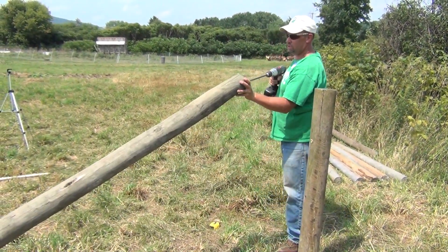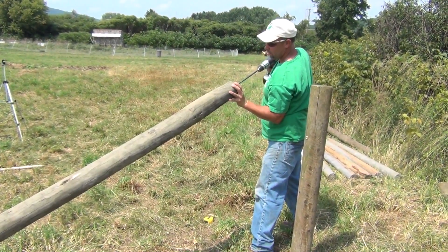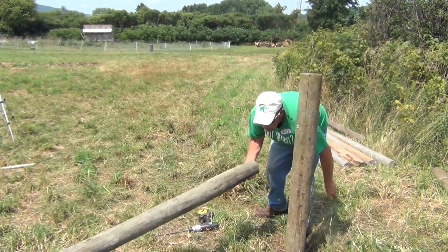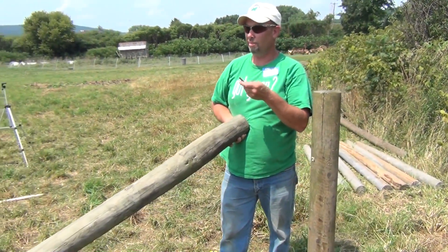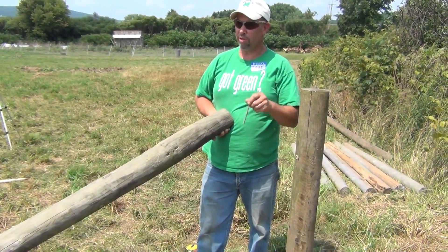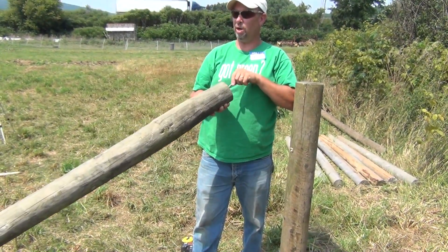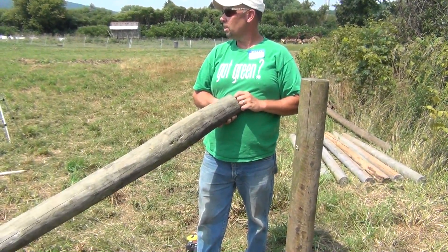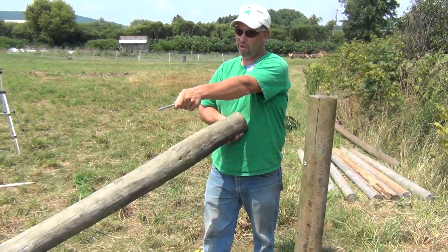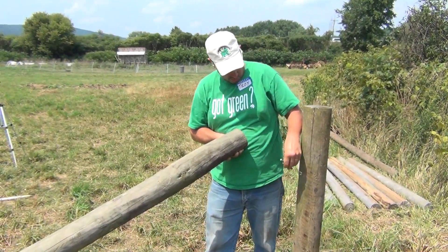You've got to hold the rail up. Many people use a bolt, but what happens to a bolt that's not galvanized? It rusts. And when it rusts inside the post, it falls down and rots. So you need just as good components as your 30-year wire. That's why you use galvanized pins — they're a little more expensive, but you should buy them and put them in.